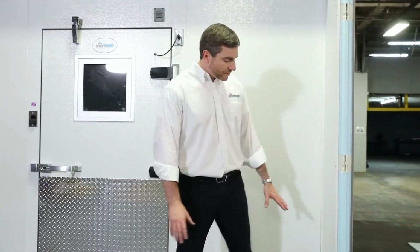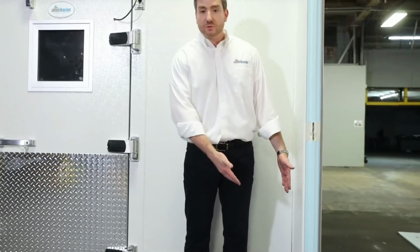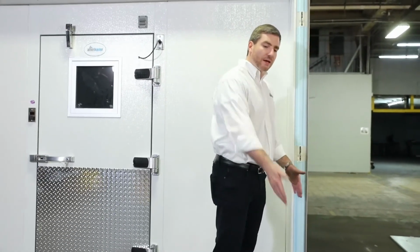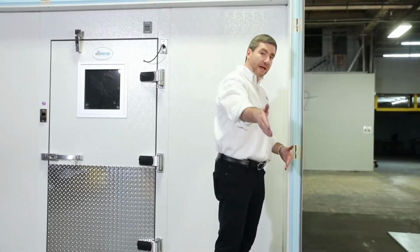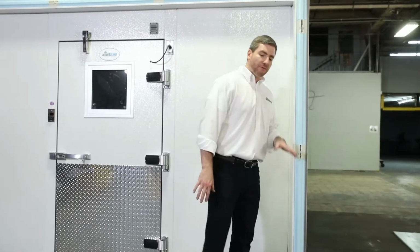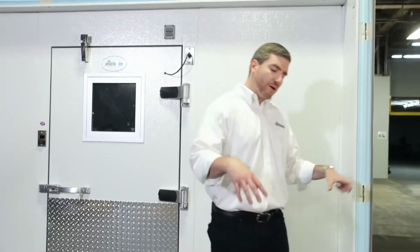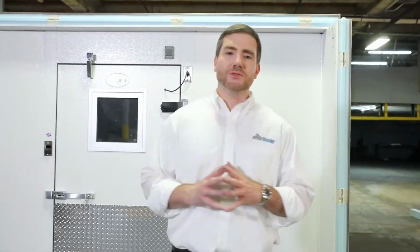So you can see we already started off by putting it underneath the first walls here on the partition. And to continue this, we're gonna lay down a chalk line, which will indicate the perfect angle with which to lay these. And before we put the vinyl screed down, we're gonna put a bead of silicone. And then I'm gonna show you how we actually fasten the vinyl screed to the floor. So stay tuned, it's gonna get very interesting. Thank you.